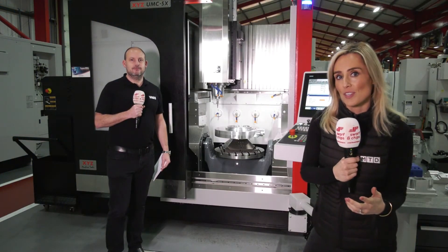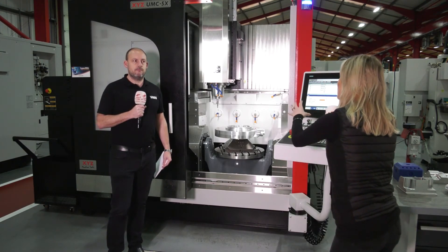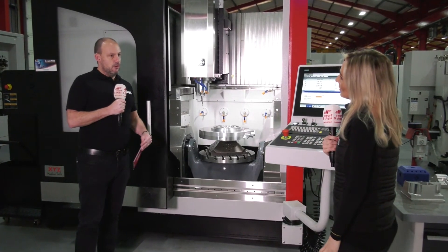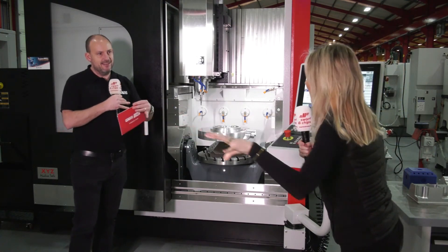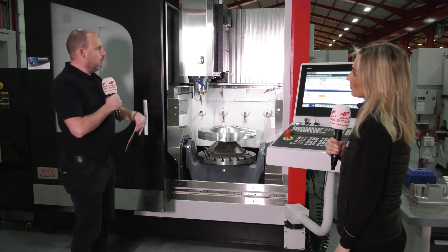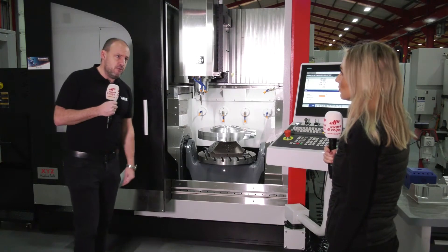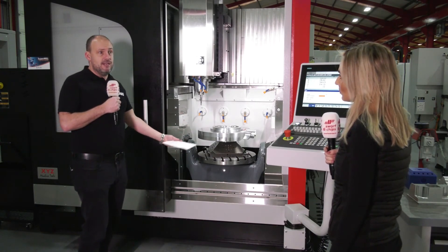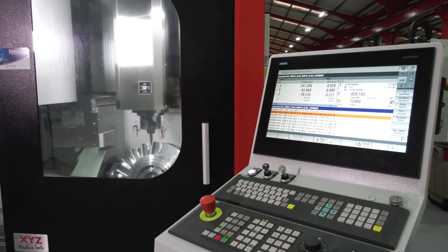To finalise, we're going to talk about the options of this machine. This is a premium five-axis machine that comes with a lot of options as standard. The things we've covered in the first three sections — construction, table, configuration — you can't change them; those are built in. But then you can expand the tool changer: you can have 24, 32, 48, or 60 tools. Twenty-four might not seem many, but a toolmaker doing an eight-hour surfacing operation might not need many tools, whereas automotive or aerospace work might need 60.